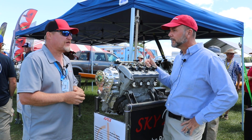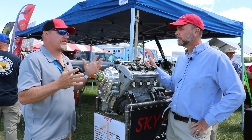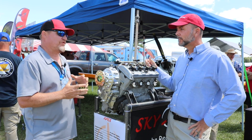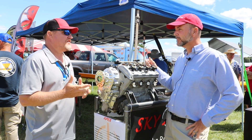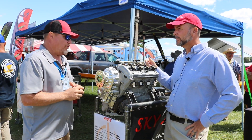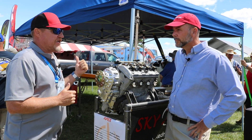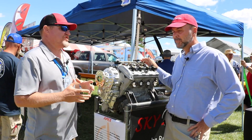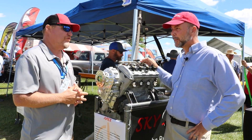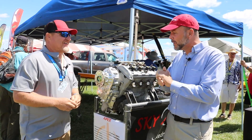For the most part, with propeller noise and all the other noise in the airplane, you really can't hear the gearbox too much. But early on in testing it did get quieter with helical gears. We're not currently using helically cut gears on the other gearboxes because there are byproducts with helical gears — like axial loads and thrust forces that you introduce — so we haven't changed that over on our other gearboxes.